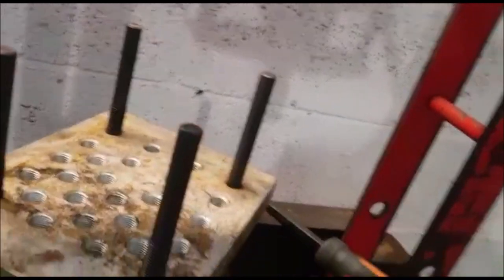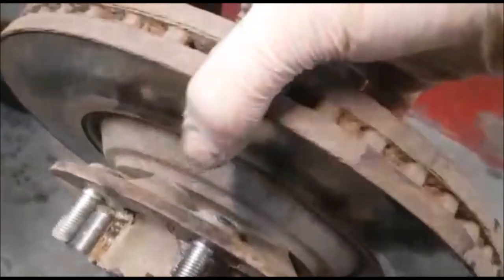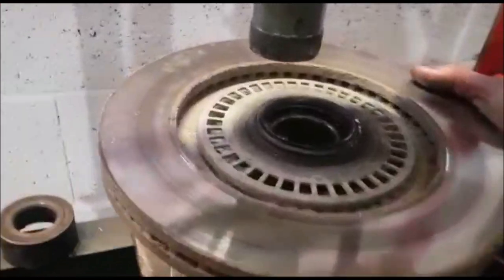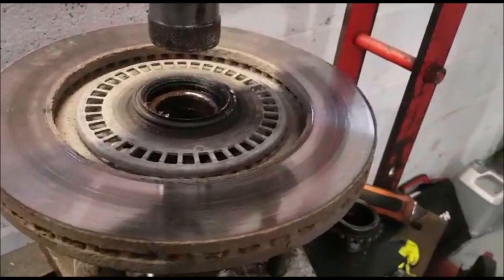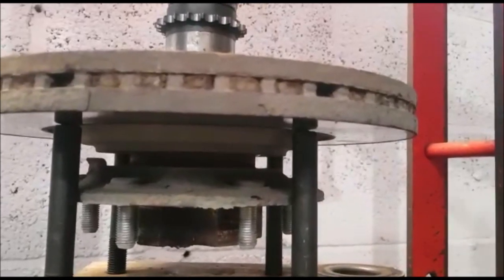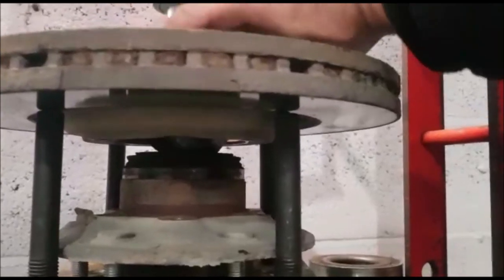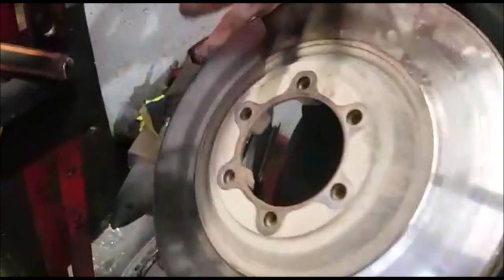This is the sort of thing we've made up to try and get the bearing out. You can probably tap it or lever it on the edge to try and split the bearing from the disc, but it's not ideal. So we're just going to put it in the press — makes it a bit quicker and easier. Pushing the bearing out the middle. There we go — just left with the disc on its own.